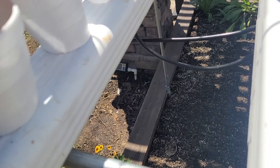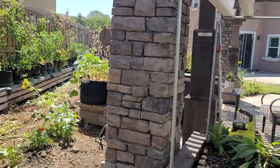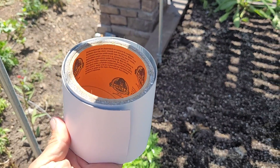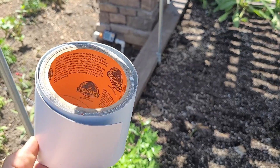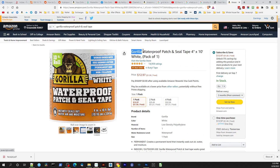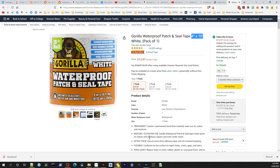I applied a piece of tape on the outside of the gutter and also a piece on the inside, as you can see. It comes in white, so if you need to make a repair it doesn't stand out. So if you mess something up on your downspout — whether drilling something wrong or getting a crack — this is a great way to repair it. You can pick this up at Home Depot or on Amazon; it's $13 for a 10-foot strip by 4 inch. I'll leave links in the description for both the waterproof tape and the rubber grommets.